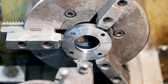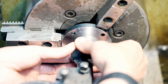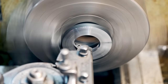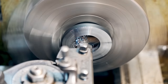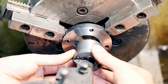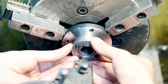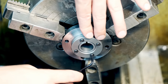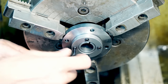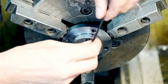The carbide insert did the trick. Let's see if this goes in now. It doesn't go in yet, but it's getting really close. The inside looks really nice, so we can take a little bit more. Okay, I think we're really close now — let's try. And it is actually going in. I'm going to tighten the taper bushing to see when it bites. It bites already with almost no effort — super solid. Perfect.